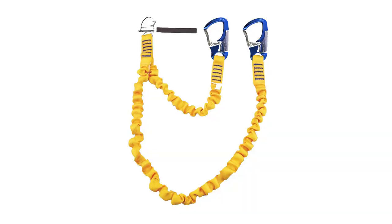At the high end of the range, there are twin tethers — three foot and six foot with locking clips — so you can leapfrog up the jack line if you need to. You can also tie yourself off short. These tethers and harnesses are not necessarily going to keep you on the boat, depending on the size of your boat and where your jack lines are. You could end up over the side and in the water but still connected to the boat, and then it's a matter of getting you back on board — which itself could be a dangerous situation.